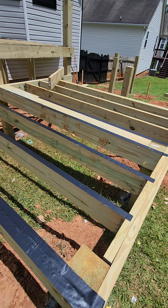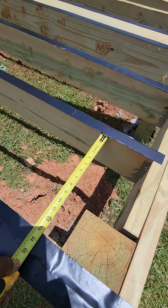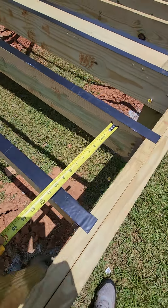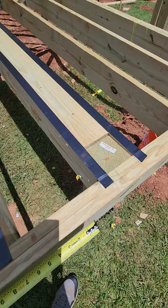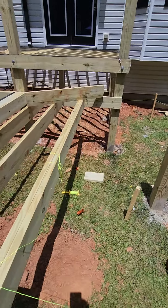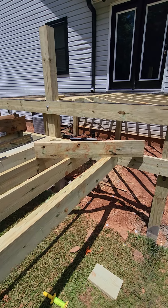You can see the joists are installed and they have joist tape, which looks good, but every joist is off. We've got 13 and a quarter inches on one, and a little under 13 — about 12 and three-eighths — on another. Every joist is off; the height of the deck is not right. They make tools and laser systems to get that right.